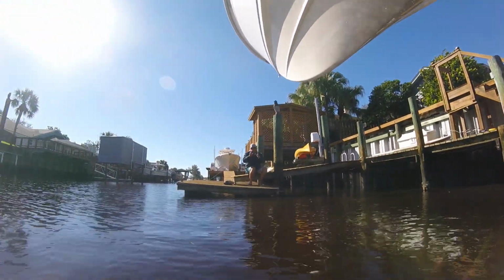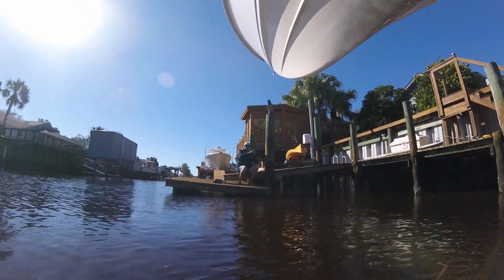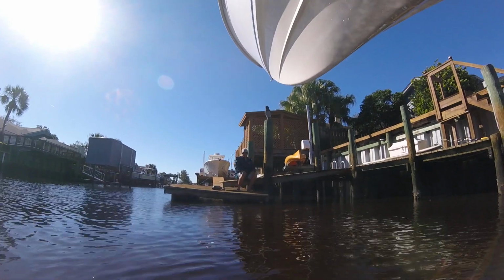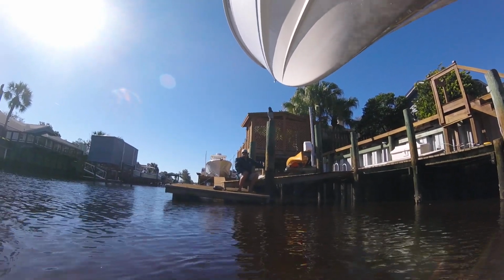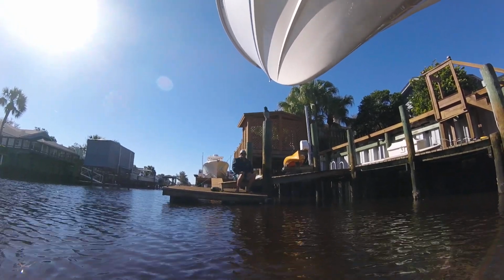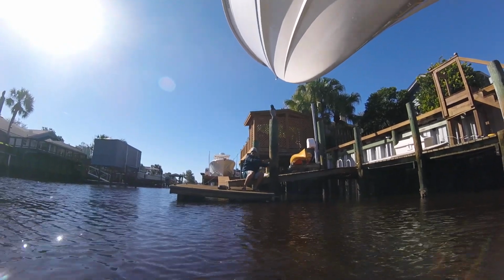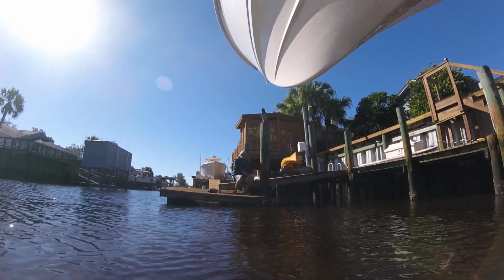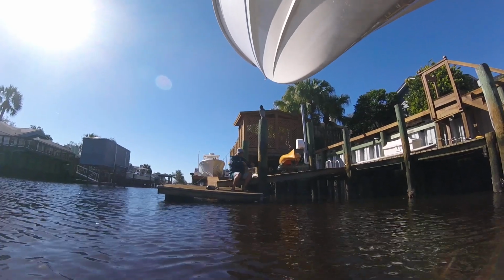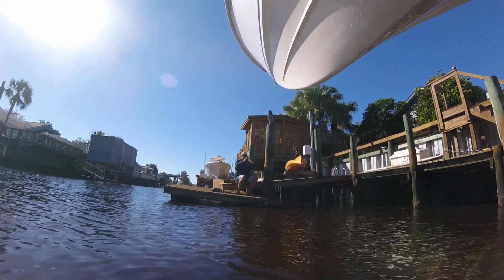When we do fill them, Tom was just telling you about the pile tape that kills the borers. Just know that if we fill a pile, it gets filled, then it gets pile tape over it, and then it gets wrapped. So these back poles where he said they could just be wrapped, yes, we'd put an underlayment on them and wrap them. That's fine. A pole that gets taped is going to get cleaned, taped, then the underlayment, then the pile wrap over it. The pole that gets filled is going to be cleaned, filled, pile taped, underlayment, and wrapped. So it's kind of a build-on process.